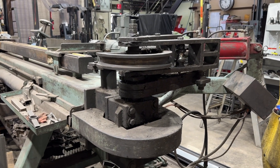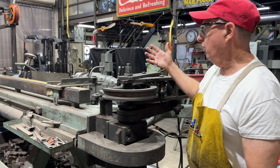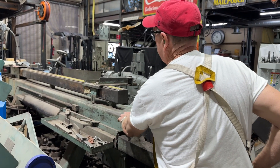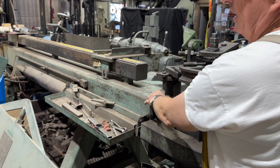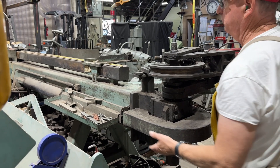The swinging frame will rotate about 190 degrees — we actually accounted for spring back in some of the harder materials you have to bend. It started out life, believe it or not, as a piece of 10 inch by 10 inch tube, quarter inch wall that I had out in the yard. That forms the basic body of the machine, and it's also the hydraulic reservoir — the hydraulic tank — so it serves two purposes.